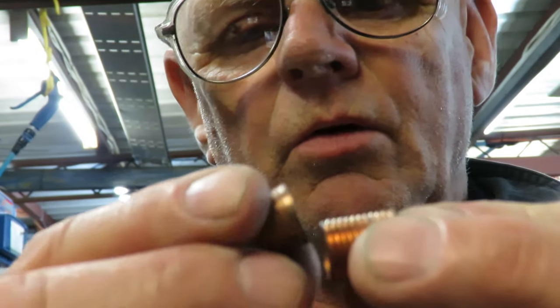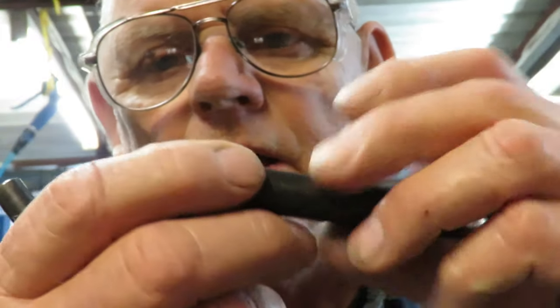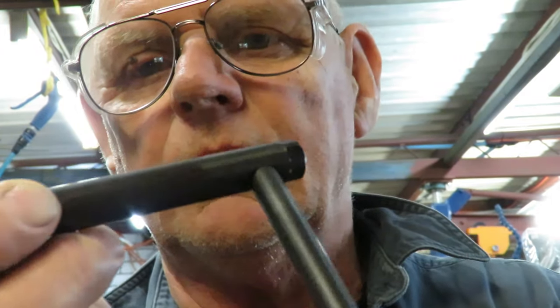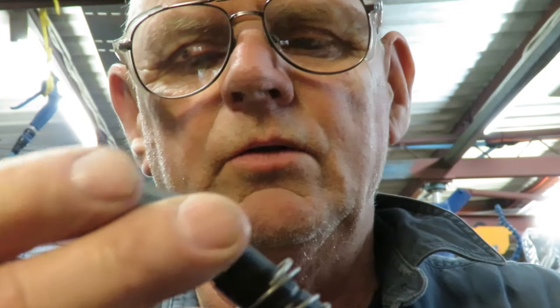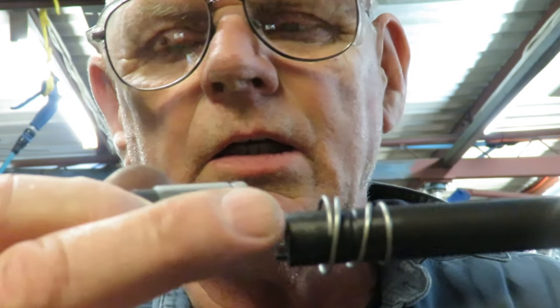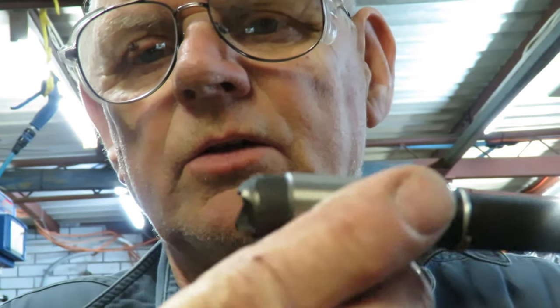This one here is a bit longer than that one. Now these are made to work by hand, so they also come with a hand tool. It's got a hexagon on one end and a slot through it that you can put the handle in. The tang engages in the slot, the spring comes over it, and you can hand ream with it. But we're going to put it in the mill and only use the drive part.